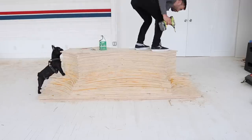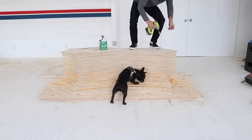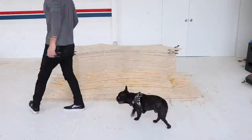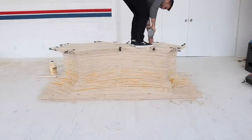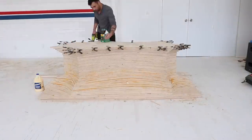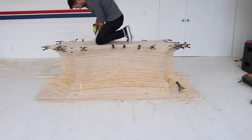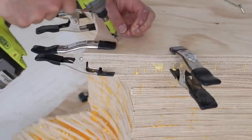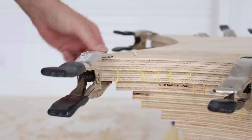Back to the build and back to hanging with Cooper. This was a traveling project so I didn't have any large clamps with me, but if I was doing this in my workshop I'd probably use large bar clamps to force big sections of the table together, get really nice tight laminations, and then use long lag screws to connect those sections — which would also allow the table to be taken apart in two to three sections for easier moving. As I started getting to the bottom of the table the pieces start flaring out, so I used 99-cent squeeze clamps again to make sure there were no gaps. When working around these edges I drove my screws in at an angle so I don't risk chipping the blade on my angle grinder during the power carving.